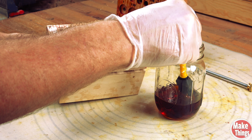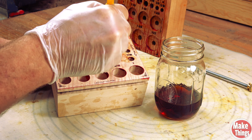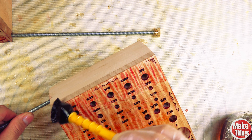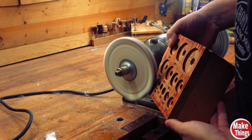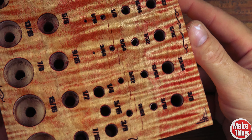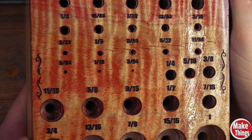To add a protective finish, I did a combination of techniques. First, I cut my poly with paint thinner so that I could really get the poly into the wood grain. Cutting poly also makes it easy to apply with a brush without leaving marks behind. I added a couple of layers before sanding with 600 grit. Then I used my buffer with an aluminum oxide compound to get a near mirror result. Finally, I added a coat of Danish oil, and you can see how incredible this entire combination of dyes and finishes come together.